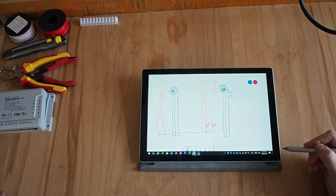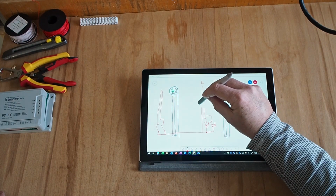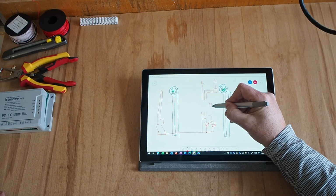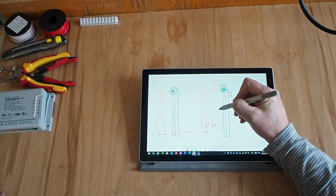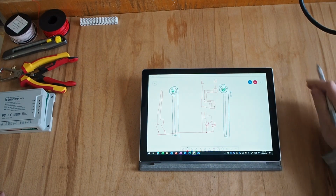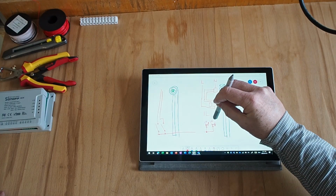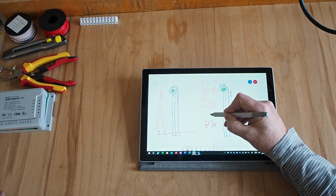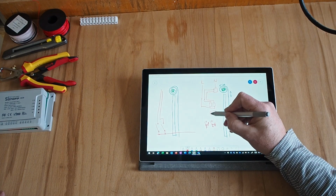So if I wanted to automate that, what I need to do is replace those physical buttons by relays. So I will disconnect this cable here. I will have 2 relays in here. One coming up here, second coming there. They will be connected to the phase. Now those 2 buttons, they'll be disconnected from the mains. And they will be connected to Arduino. So they'll be connected to pins.